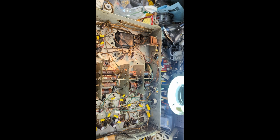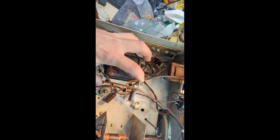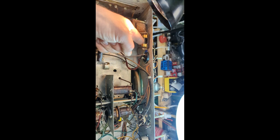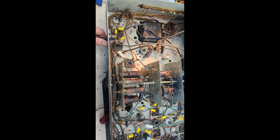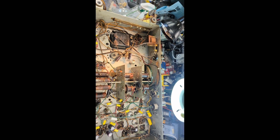I don't have the speaker with me, but I installed a safety fuse — this goes on one end of the line so that if something goes haywire with the transformer, this will blow first before the transformer smokes your house out. Unpleasant — I've had it happen before and the smell lingers forever. I've done as much as I can without the speaker, so I'm going to put it back on the truck and give it a test either today or tomorrow.